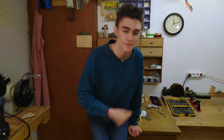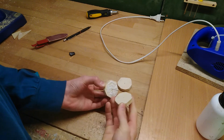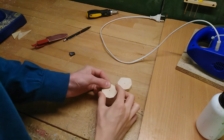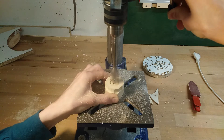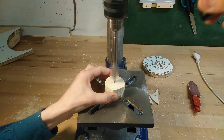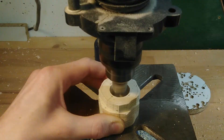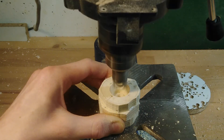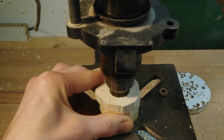To put an end to the self-adulation, let's do the upper wheel. The upper wheel is made up of three layers of 10mm plywood with a recess for a ball bearing on either side. The middle is drilled out to 16mm, and since I don't have a Forstner bit that size, I'm simply diverting a plug cutter for the job.